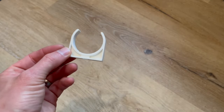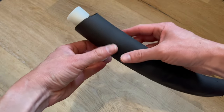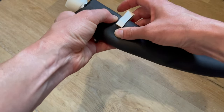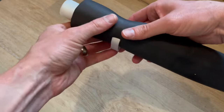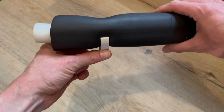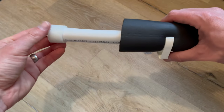I purchased 40-millimeter pipe clamps on Amazon. My idea is to put the PEX in the insulation and then use these pipe clamps. You can buy 50-millimeter clamps, but that's a little too loose — I'd recommend the 40-millimeter for three-quarter inch PEX. It holds nice and tight with just one screw. I'll be screwing these into the joists in the attic. You push the whole insulated assembly down into the clamp rather than trying to clamp the pipe first and then insulate around it.